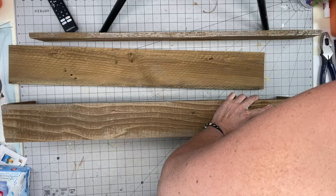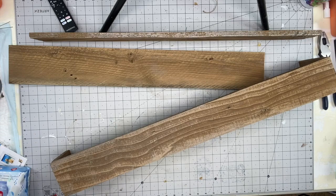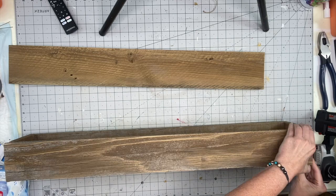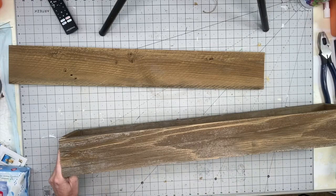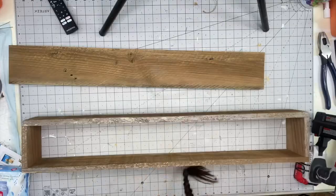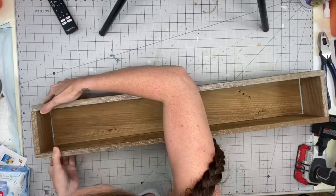I'm going to staple — top, bottom, middle — on each side. You guys, invest in a nail gun. Mine is a battery-operated nail gun. We're just going to attach the second side. Now if I were selling this in my booth I would definitely apply some wood glue on these pieces and then nail it, but since it's for personal use I was totally fine with just nails. If you don't have a nail gun you can use an old school hammer and nails.